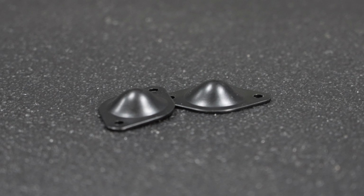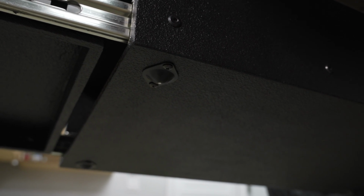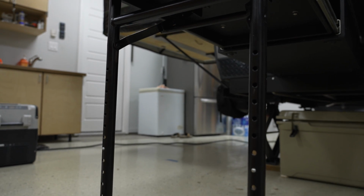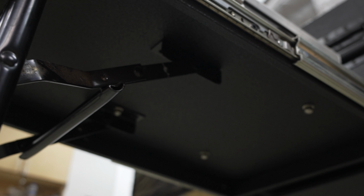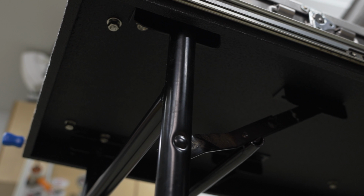On the bottom, I installed these industrial road case metal feet to make it easier to slide around and to keep off the ground. The legs were the hardest thing to find. They needed to be narrow, adjustable legs that also folded. The most expensive thing about this build because you only needed one and they came in a pair. So I chose to mount the folding legs all the way through the drawer and into the stove using a bolt and a nut, instead of using a short screw into the 1/2 inch plywood. This is an overall better connection versus using a traditional screw.